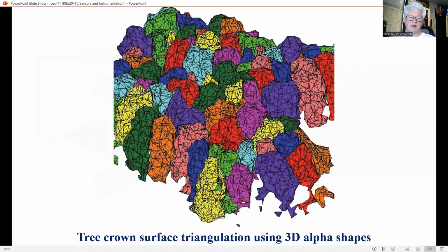One of the limitations of resolution in a structured light system with lines or with other patterns is caused by the line width of the projected light. Several researchers have proposed methods to improve the resolution by using special image processing algorithms. Examples can be found where the shape of trees is determined using triangulation, in which the obtained improvement of the resolution is illustrated by the shape measurement of a car tire.